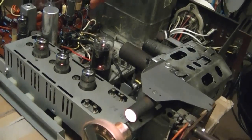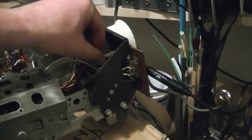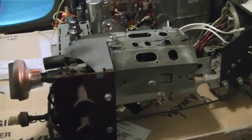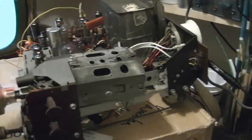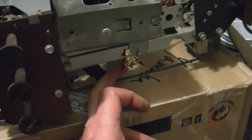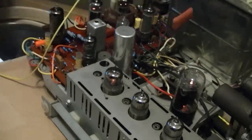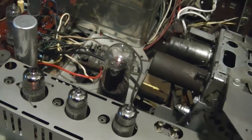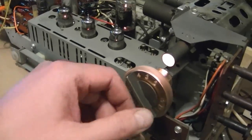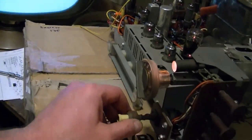I'll somehow have to get some test probes on this thing and figure out a way to have this chassis flipped upside down with that cable hooked up, and start doing some checks. I did trace out the wiring to that orange wire — the B+ — and it's definitely going to a resistor that's tied right to the main B-plus supply for the whole set. So I really don't see how that could be the problem, and the tubes are lit up. Could the AGC bus be so off that there's zero reaction from the tuner? There's always some kind of reaction when you change the channels, so I just don't see how it could be the AGC.